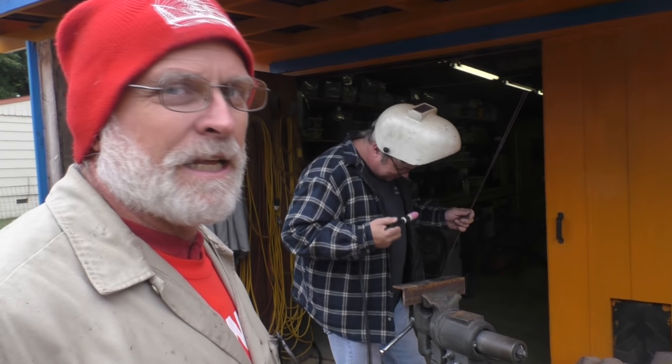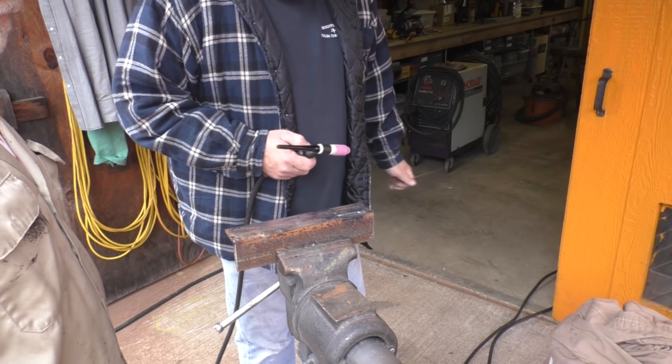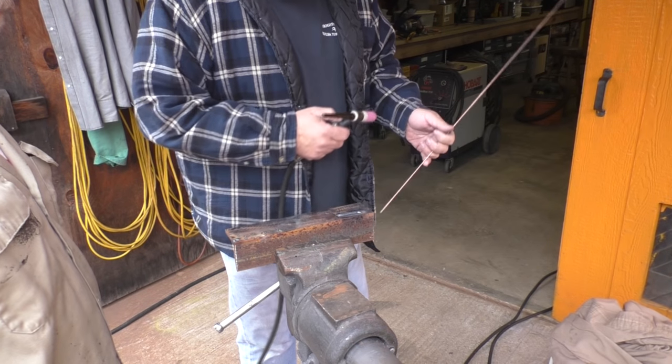You remember Dave? Dave's back. He's going to teach us how to TIG today. Can you just dip it every once in a while and then push the puddle along? I was just washing it then. I like to side drip. It's what I usually like to do. But the easiest way to learn is just wash over it.